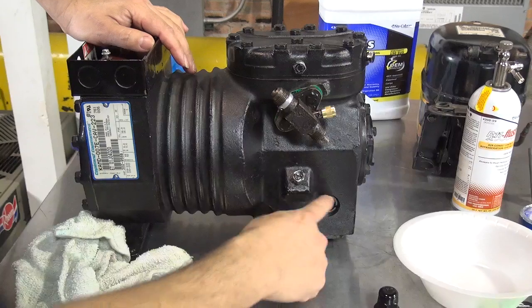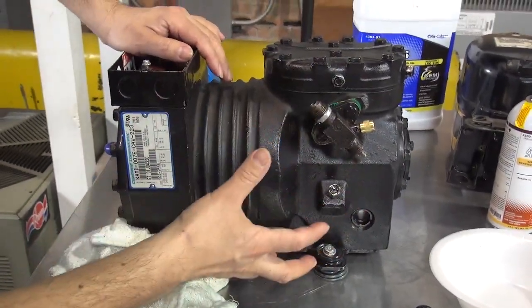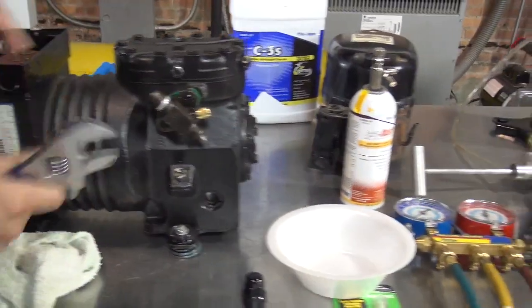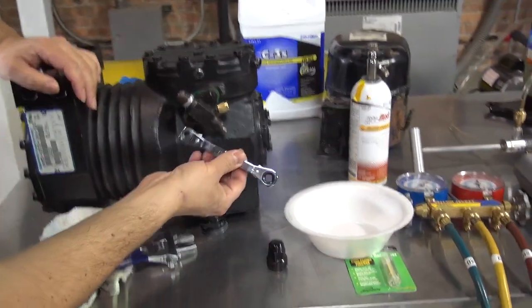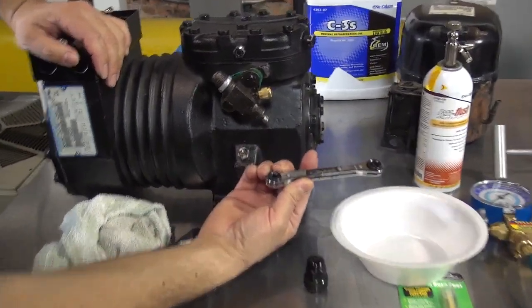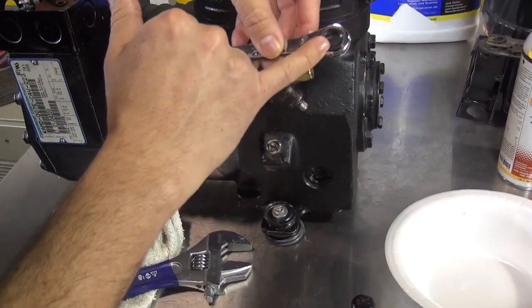And also there's a gasket right here on the side glass. So there's places where there's going to be leaks. You can put a brand new gasket. Okay. Now I was talking about the king valve here. You gotta use the proper tools to move the king valve. In this case, we're gonna use what is called the service wrench. And this service wrench comes in different sizes right here.